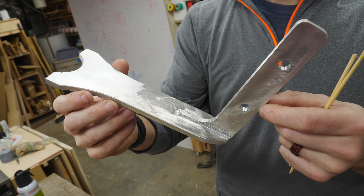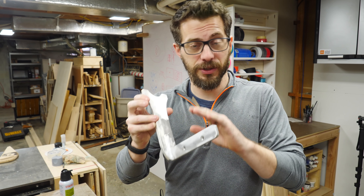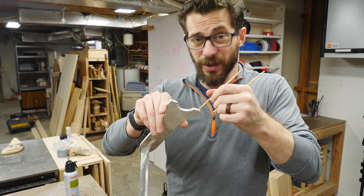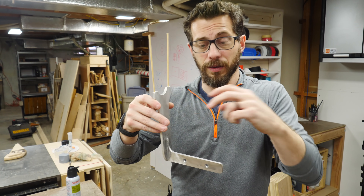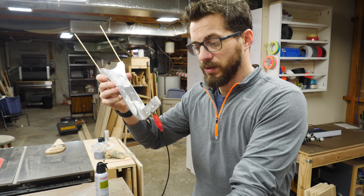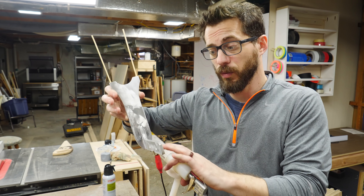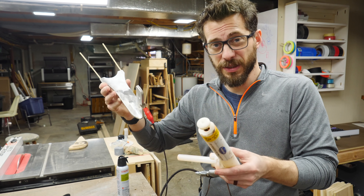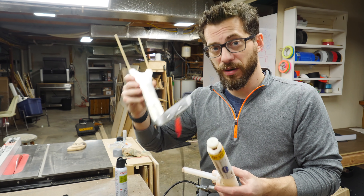With the brazing done, I went ahead and cleaned up all the surface of this to get rid of any other stuff before powder coating. You could just spray paint it, but the powder coat will give it a little bit better surface, a little bit harder finish. One thing I want to do before I powder coat it is actually fill in these areas with the thread so they don't get coated. I've got these small pieces of bamboo, and I'm just sticking them in there so we can spray the rest of the whole thing and it won't get down in those holes. The powder coating process is really simple — you put a lead on the thing you're coating, then you use this gun to spray the powder over it. This thing gets charged so the powder is drawn to the metal, and then once you get it completely covered, you put the whole thing in an oven and it bakes that powder into a hard finish. This is a DIY kit, a pretty inexpensive option to powder coat something, and you can get a smaller oven which isn't terribly expensive — it's a great way to put a hard finish on one of your projects.